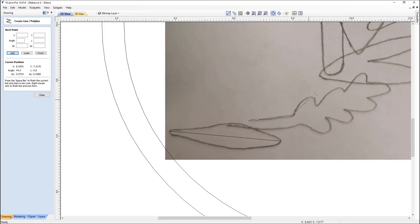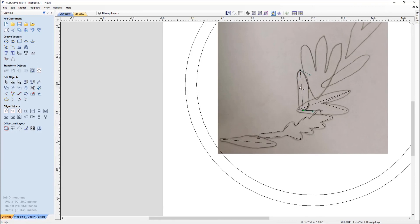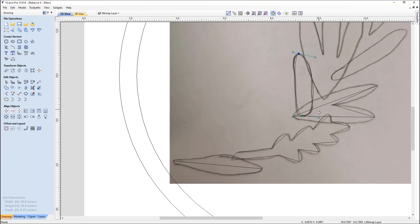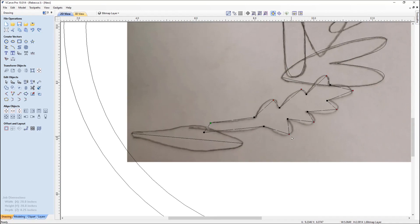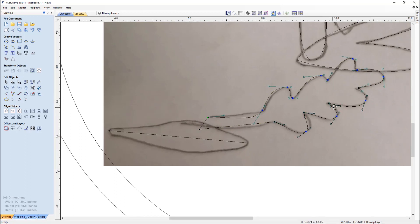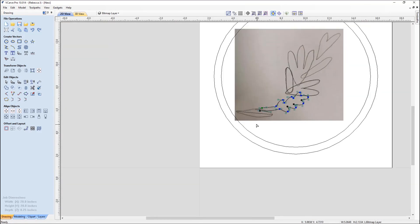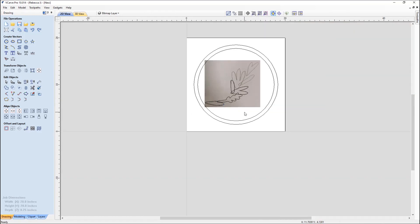I have a sketch that I drew out, took a photo of, and brought onto my PC. I've copied that image into the software and I'm tracing around it using the polyline tool. The polyline tool lets me roughly sketch the shapes, and then by putting these vectors into node edit mode I can really control them to get the shapes I desire. The blue nodes are smooth points which I can alter in node edit mode to get a nice smooth shape. I can alter the spans of a vector by pulling on them and adjust the control handles until I have the correct shape. These elements represent the bottom portion of our wreath.